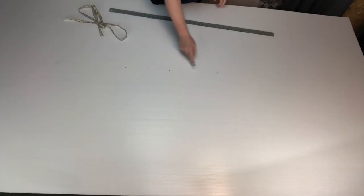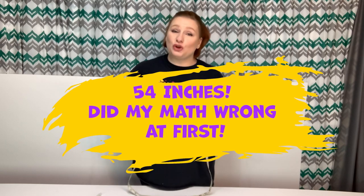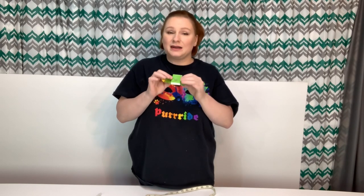So I have given myself a guide going all the way down the middle, just so I kind of know where everything is. I have short arms. I can't be reaching all the way across. So it's just a little helper. So now I'm going to be using my floppy tape measure to be able to find a 48-inch diameter circle and a 50.5-inch circle. I'm going to make the band going all the way around 2.5 inches. So I need to make 2 arcs from the exact same central spot. And because I don't want to be putting push pins all into this board, I just have a little cheat piece that I've made that I can put my push pin in to be able to anchor, and it sticks in place.